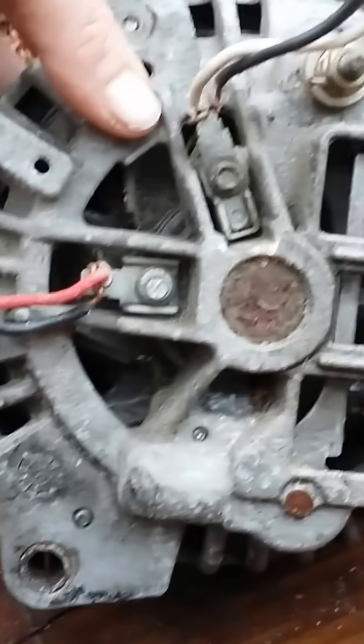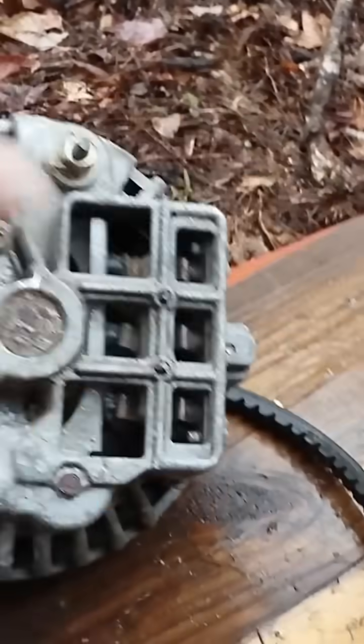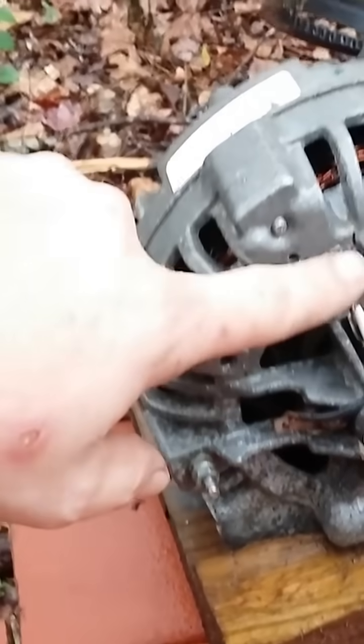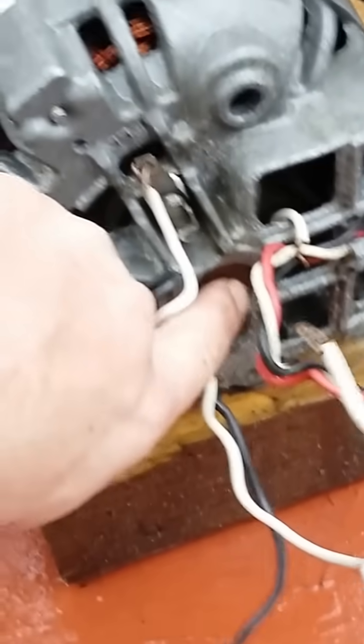So if you want to build a welder, you can do that. You have your field wires — I did a lot of different tests so I have multiple wires going. This one's already made, this is a generator. I took my two field wires and you put anywhere from three to twelve volts DC to this. You bypass your diodes and you'll get three wires that are actually your coil, wrapped around your stator.